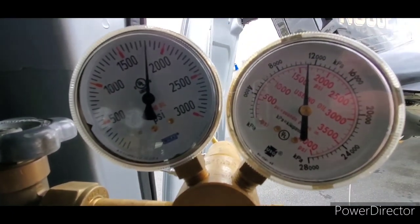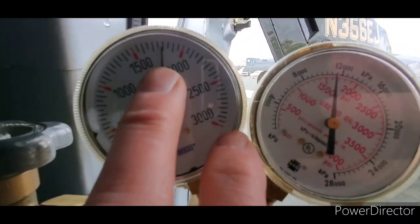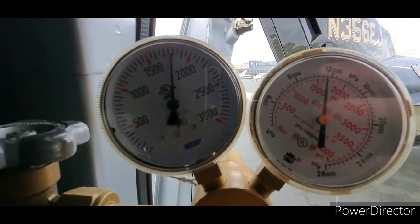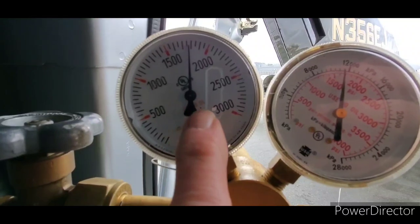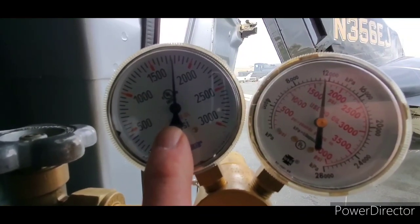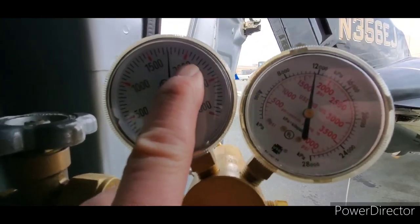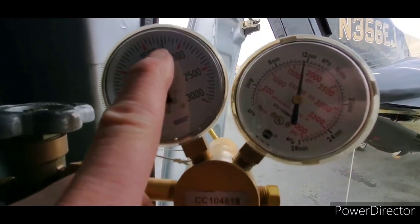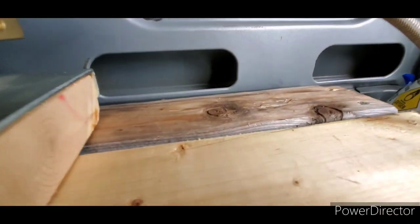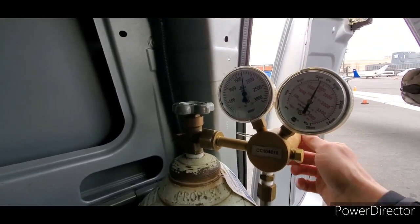The reason you want an oxygen booster is because right now my fill bottle is reading 1,800 and dropping, and that means I'm only at three quarters on the airplane — I will not hit 1,800 on the aircraft. I've worked at places that did not have an oxygen booster and we went through bottles left and right. A full bottle might come in at 2,200 to 2,400 depending on temperature, but you're only going to get so much before it drops to 1,850. You really need about 1,900 to get past the valve. That's where you need to have a booster like this. I'll set it up.